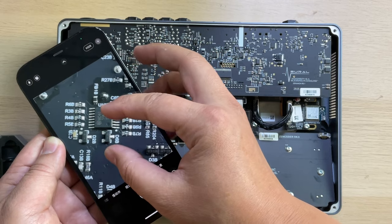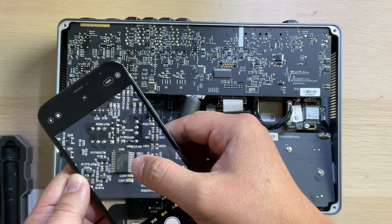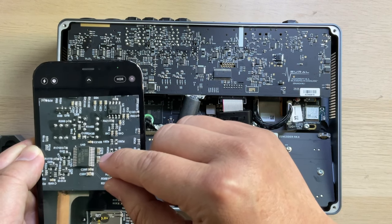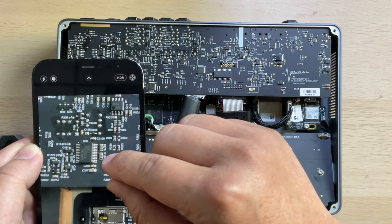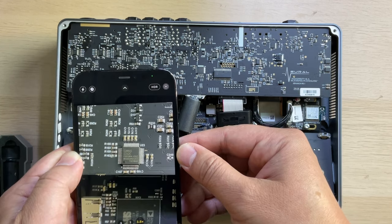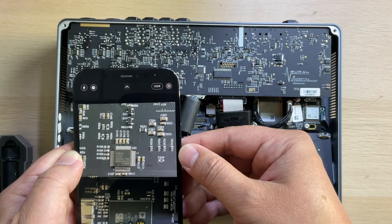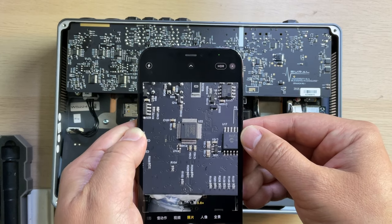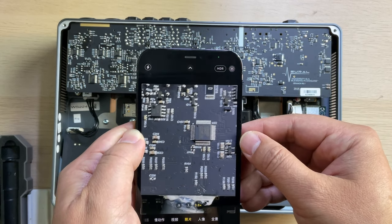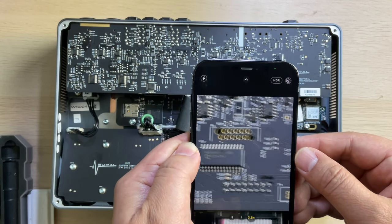This is just a digital common logic chip. So this should be a programmable op amp. With this one, we can change the analog gain using digital control. And this other one should be an ADC, and this one should be a DAC. Cirrus Logic is very good, and I have used this part for an audio interface.